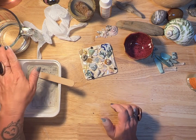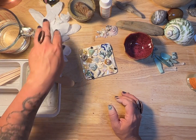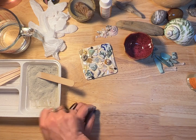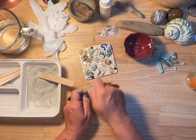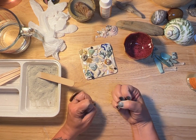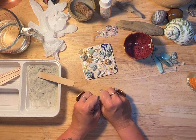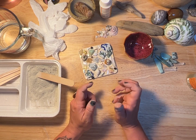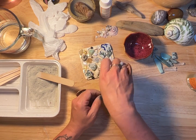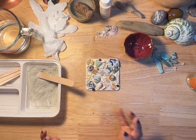And then I have my water ready to go for slow mixing. And I have gloves. You don't need gloves if you don't want them. Once you mix it and pour it on, you can totally just use your tool to do everything. But I'm very hands-on, and I know that if I don't, I'll get it all up in everything because I'm very tactile. And you're gonna want either paper towels or an old sponge to wipe off the grout afterwards, after 15 minutes. So we're gonna wait for this to dry fully and then we'll come back and mix the grout.